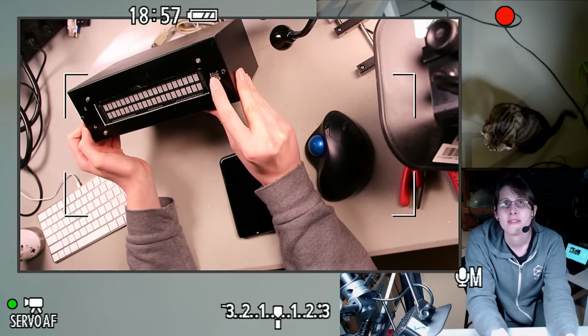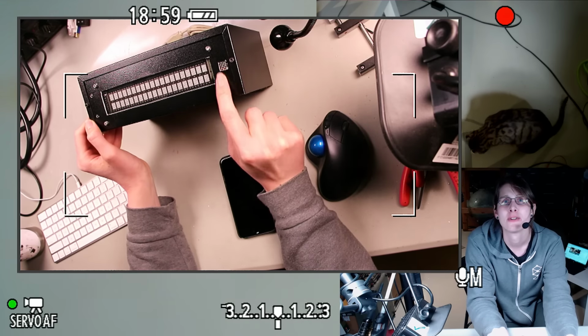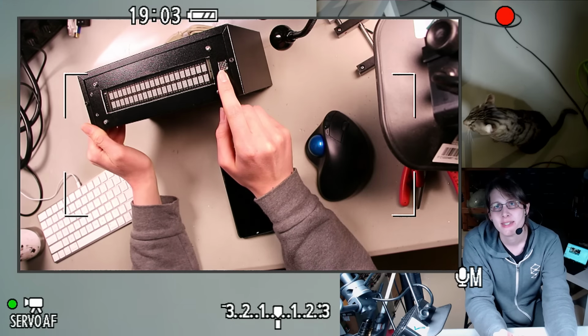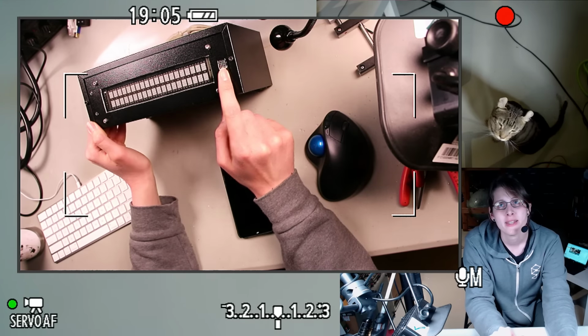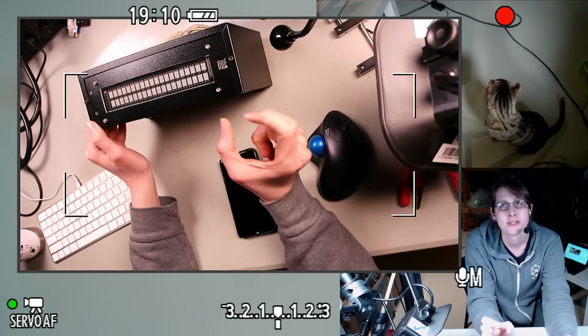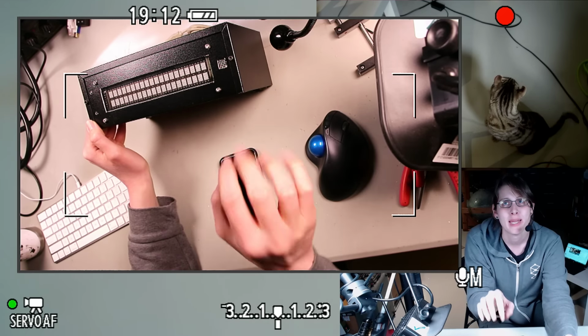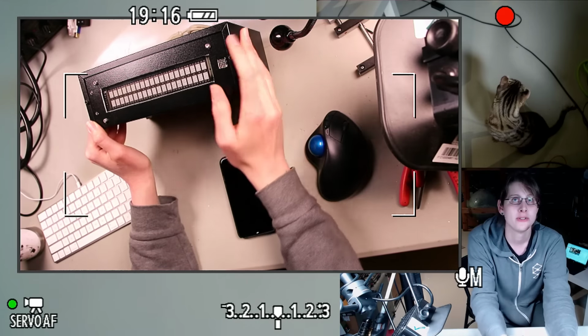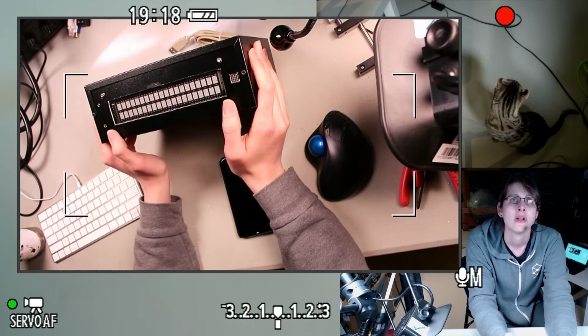And this is the front metal grill, because nowadays, if you buy one of these, it's usually just in a single chip. But I think this is one of the earlier ones where the photodiode was on the front, and then there's a little circuit board with a little epoxy blob amplifier chip, so they bothered screening the whole thing in metal to keep the electrical noise low.